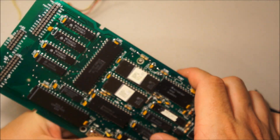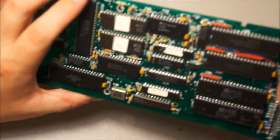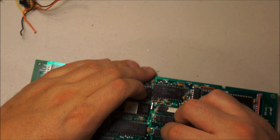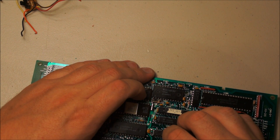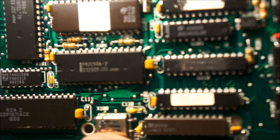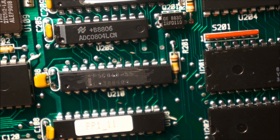So that is an Intel P5C860-55, I think. Let's see how macro this thing will go — oh yeah, it is a C. So it's P5C860-55. And I think it's Intel. There's the big device: MC146818AP. Excuse me, another opto. I wonder why they have all these optos — I guess they must be trying to isolate ground domains.